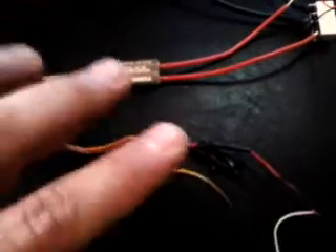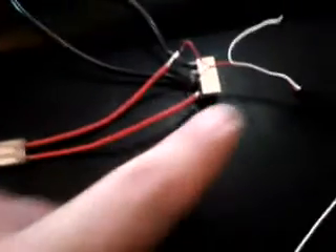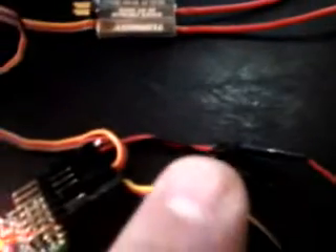So you're feeding both the receiver and the relay with 5 volts at the same time, while sharing the ground between the battery and the switch. This makes it work — sharing both grounds. This black wire over here is going to the same source as this black wire over here that goes to the receiver. So there you go, this makes it work.